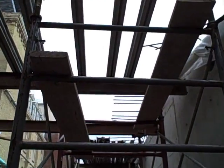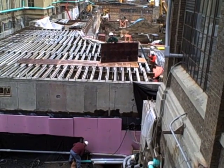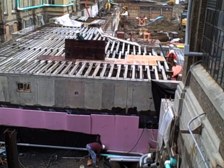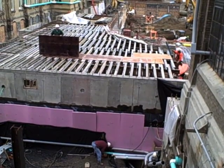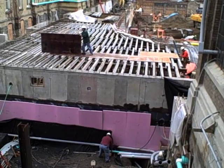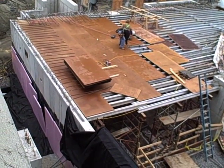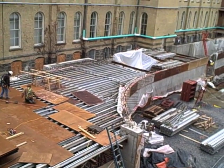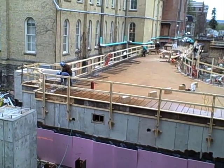Shoring is built up from the basement slab, much like any other steel structure consisting of posts, beams, and closely spaced joists. In this case, though, the structural elements are temporary and reusable. Because the bottom surface of the first floor slabs will be visible as the basement ceiling, care is taken in placing the wooden boards over the metal formwork joists. A special type of overlaid plywood with a surface layer of medium-density fiber is used. A form-release agent is brushed onto this wooden surface.